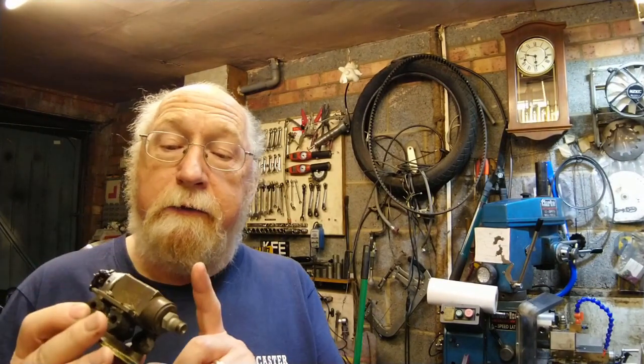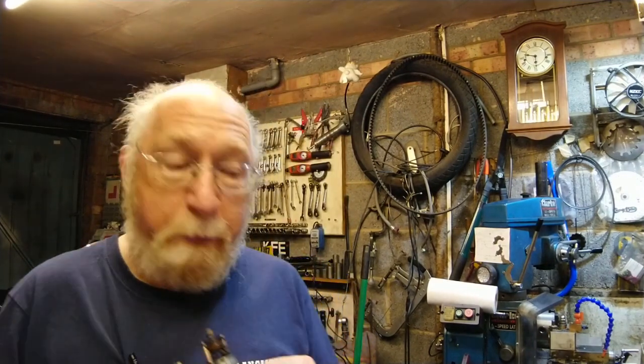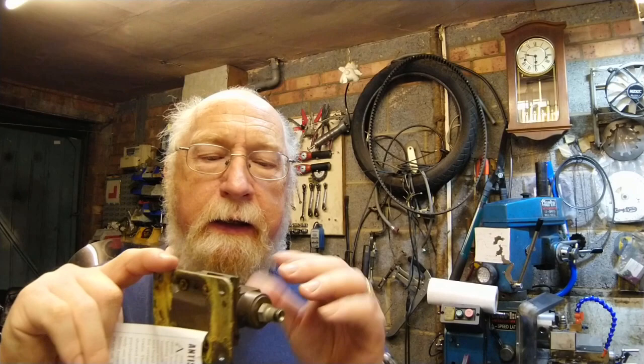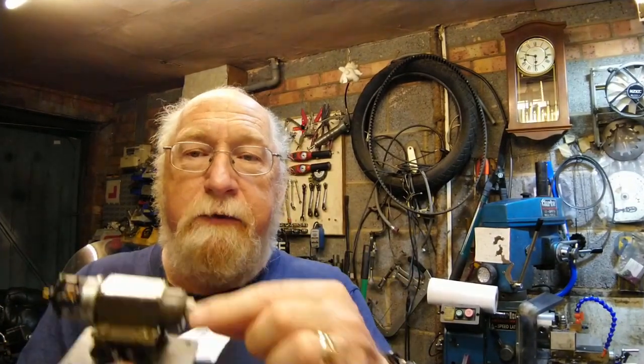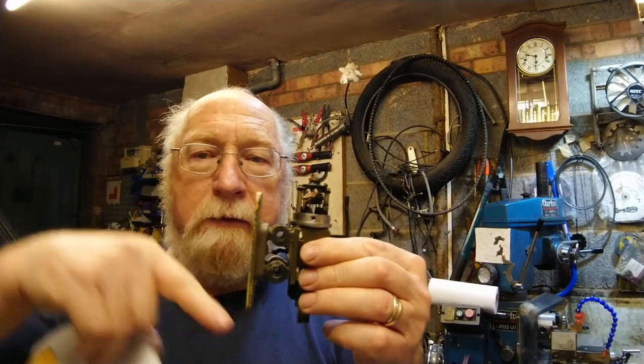I found an advert for a similar pressure transducer — I'll put a picture of it up. The one in the advert is slightly different: it's a bulkhead fitting that clamps straight in, so all you've got is a flange at one end with no separate mounting plate. That advert dates from the 1950s and it's a 24-volt unit, which makes me think jet engine rather than internal combustion — as well as the pressure range of 0-60 PSI. If you're running at 40 PSI, you're bang in the middle of the range, right where the needle should sit.